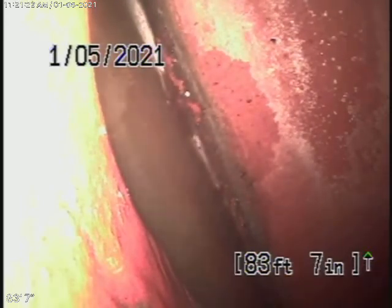We're here at 1314 Fairfield Street in Glendale. We had a little look underneath the house and it looks like pretty much everything's ABS plastic, and it looks like it was in good condition. We're running our camera from a clean-out — a 3-inch clean-out — located like an end-of-line clean-out on the right-hand side of the house.